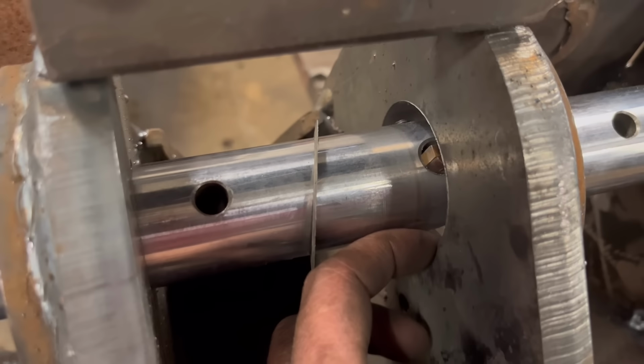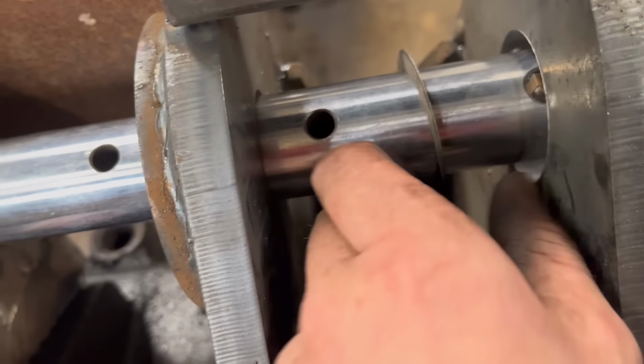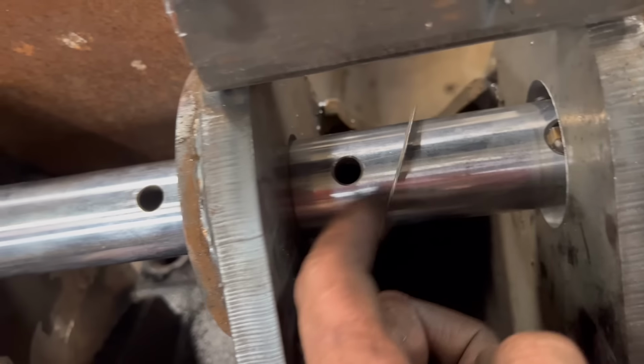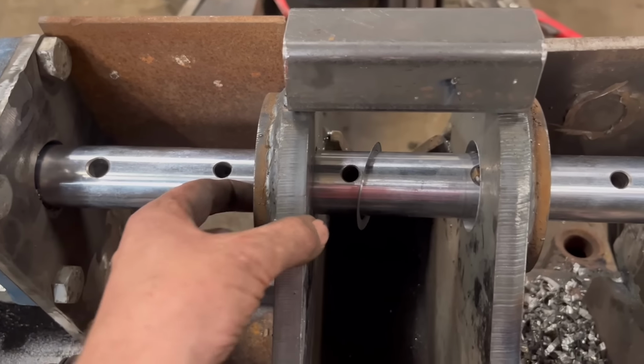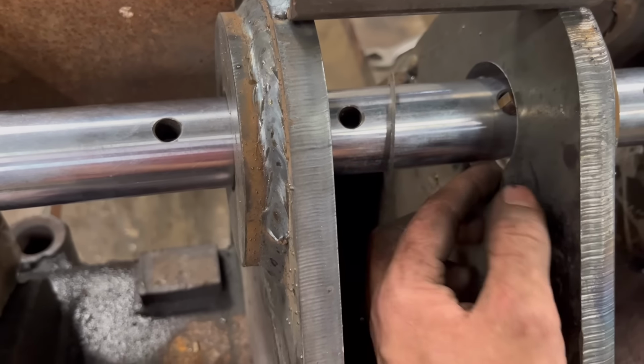That's the first one cut through the rough cut. There's a fair depth of cut was that. So I'll have to cut that off and then move the tool on to there. Well, I've got enough travel to do it, so I'll just travel it onto there, cut through that one, and then I'll maybe do another two cuts to get it out to final size.